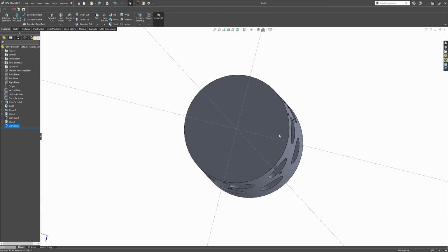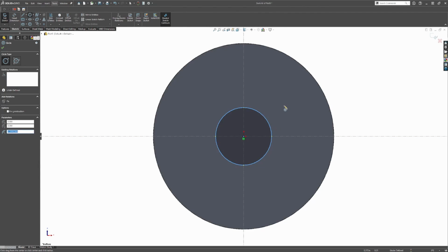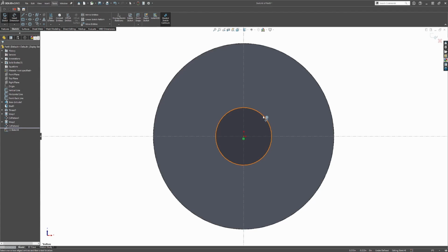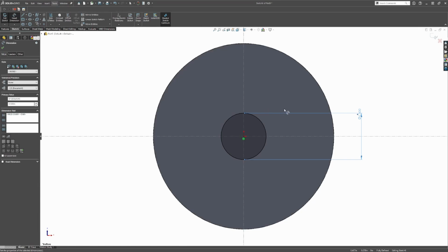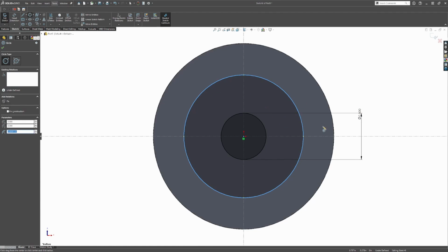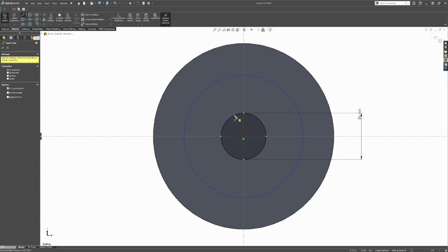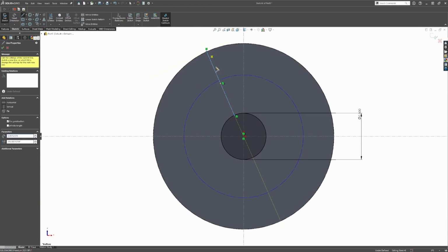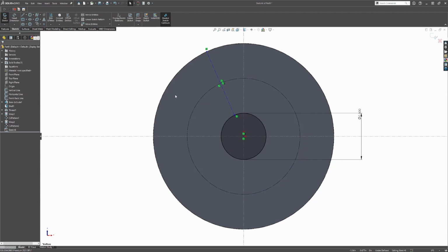Now our bottom, we just finish off the bottom piece. Since the bottom layer is where the first adhesion is, I don't like having a lot of holes. It seems to make printing it difficult. So we're going to change this to 0.5, and then I'm going to use some slots for holes. I'm making a construction circle so I can build around, and then I'm just going to space these 2. I'm spacing this circle to be exactly half of this. Perfect. And now I'm going to use this slot right here.